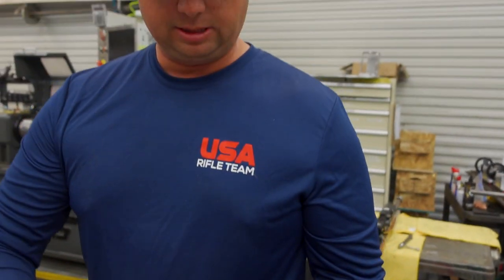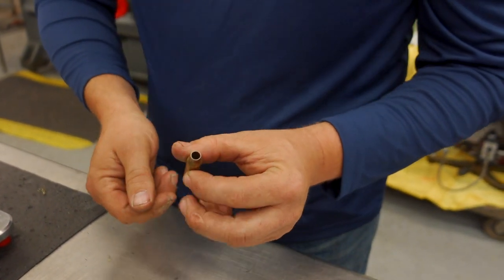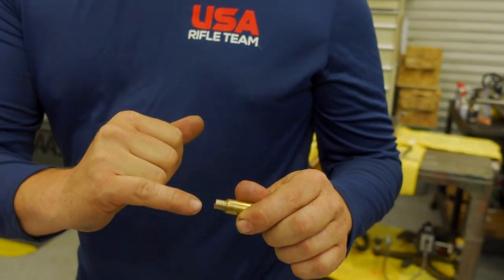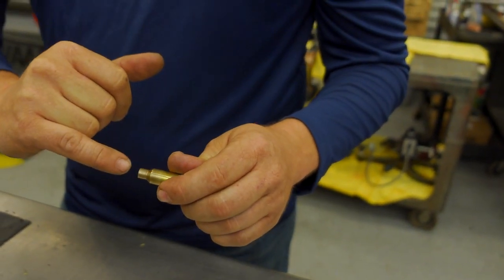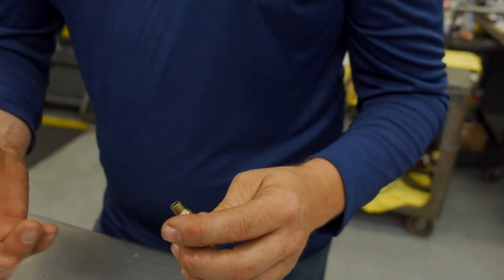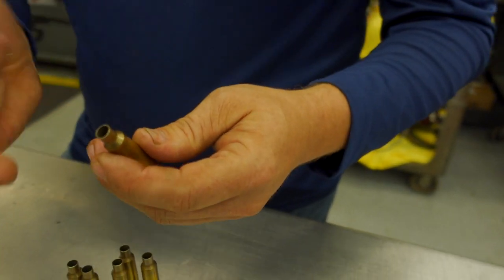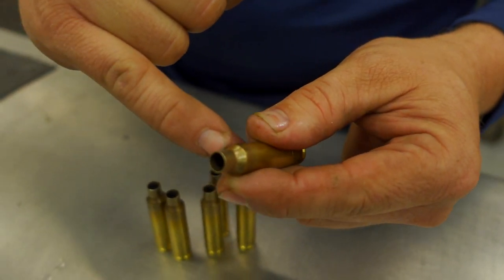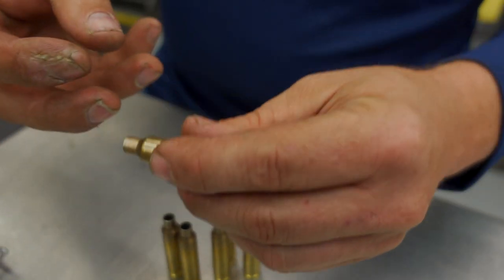So most guys, when you turn on a mandrel turner, you would just expand this on an expanding mandrel that fits a snug fit on your mandrel of your turner when you're turning just the outside. But if you check the runout, as you've seen, is 2 thousandths. If you put an indicator on the inside, it's gonna be 2 to 3 thousandths because there's neck thickness variation. Now, you'll see when you guys cut on a mandrel, you'll see cuts into your shoulder will be heavy on one side and not on the other. That's from that basically wobbling.